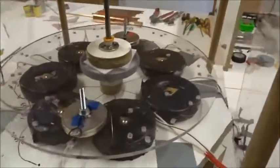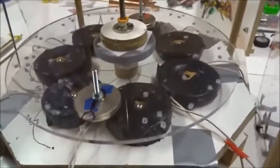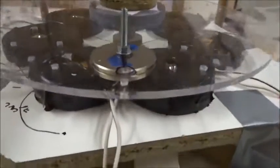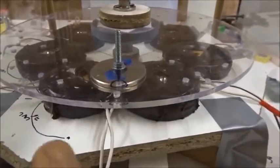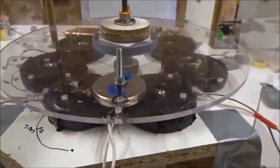The device I've made to test it has safety shielding. I've got seven wire coils — on one side we have a North magnet and on the other side a South magnet. One's red and the other's blue. They're two 60×5 millimeter Neo magnets. The red magnet is sitting on top of a wire coil and making current, while the blue magnet is sitting between two wire coils. Electromagnetic fields from the red magnet will come all the way around the circle and pull that blue magnet forward to help the rotor spin, whereas the red magnet is being slowed down by Lenz's law.